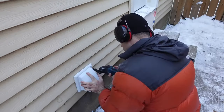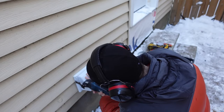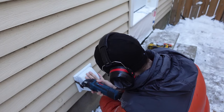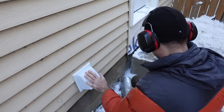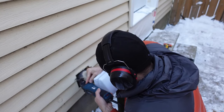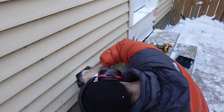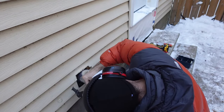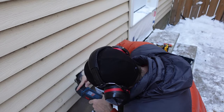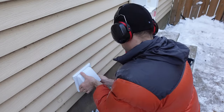I'm going to trim back the lip edge of the siding on the house — not all the siding, just a little bit where the bottom and top of each piece of siding meet. I'll trim that one high piece out so that it sits flatter against the wall, and I'll do that on both sides so that raised lip doesn't impact the dryer vent cover.